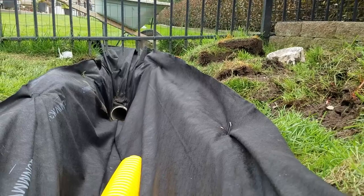We put our pipe right on this non-woven geotextile fabric. We lay it right on the bottom of the trench. The reason we do that: we're 18 inches deep — that's where the tap is. We want to get all the water out of the French drain. We don't want water to lay in the bottom of the French drain and freeze come wintertime when the frost goes to that depth.